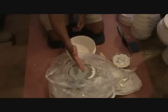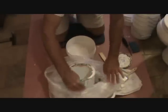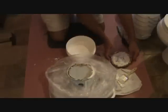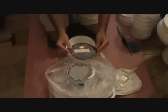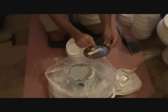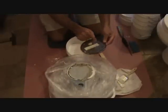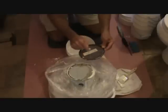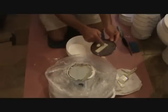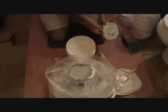So if this is a special mix of paint, the mixing solution amount or the code to that should be on the side of the paint can or on top of the lid. And I look on the top of this lid, and sure enough, it's right there. So before I throw this lid away, if I think I'm going to need to get some more of this paint later on, I need to write down all of this information here on a piece of paper or something like that before I throw this away. And also the name brand of the paint and all that.